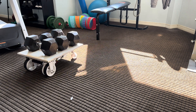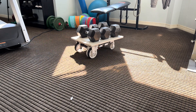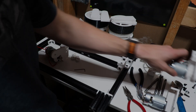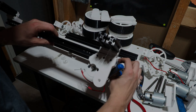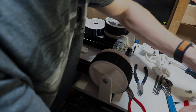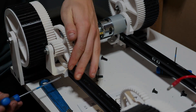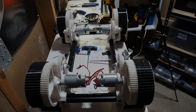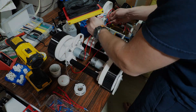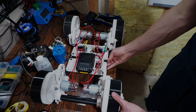Now mechanically I seemed to have enough power, but traction was now our limiting issue. I would just get wheel spin, especially when trying to start, and one of the wheels would spin so it wasn't going in a straight line. My natural solution was to go to four-wheel drive. So I printed out a new set of wheels and a new set of drive hardware, then reassembled the entire frame and wired in the new motors in parallel with the original motors.